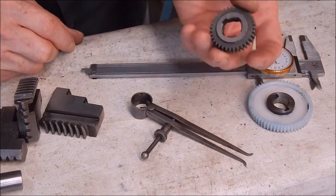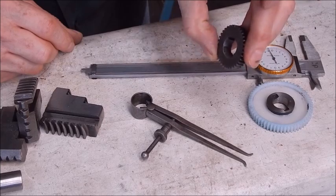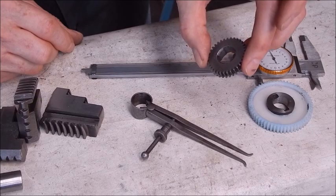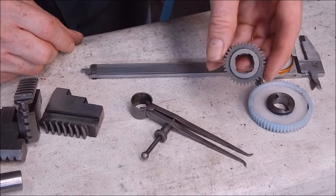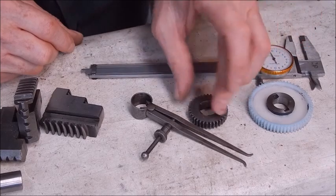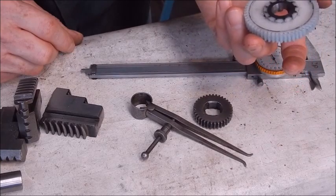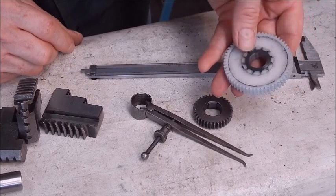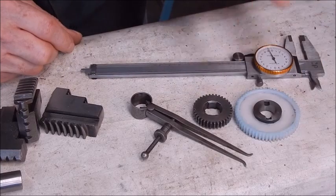The next thing is to do the keyways — splines. You can do them in the chuck with a piece of high-speed steel, just working the carriage back and forwards; there are quite a few videos on the internet showing how. That's fine for aluminium but I think you'd have trouble with cast iron. I might give it a go but I'll probably have to just file these by hand — that's how you usually finish up doing it with this sort of stuff.